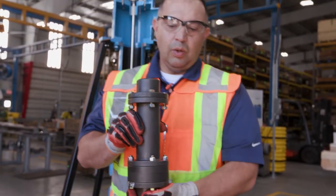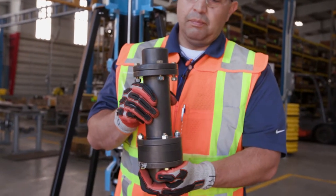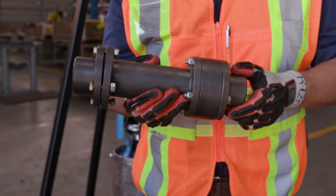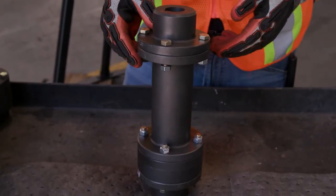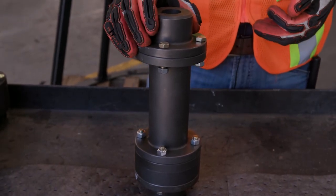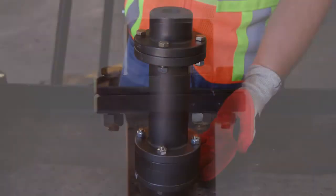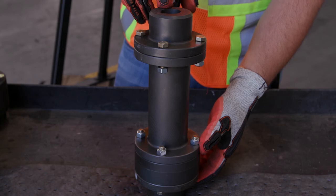This is an AS coupling, or adjustable spacer coupling. We use this coupling with mechanical seals only and vertical solid shaft motors of any horsepower. The difference between this coupling and the adjustable coupling is the addition of a spacer, and the spacer is there to allow room to remove the mechanical seal when maintenance is required. With this coupling the shafts do not butt, so there's going to be additional detailed setup to eliminate any runout. And since it's taller, the discharge head is going to have to be taller to allow for the stack-up. A fabricated steel or cast iron head with a motor support can be used with this coupling.